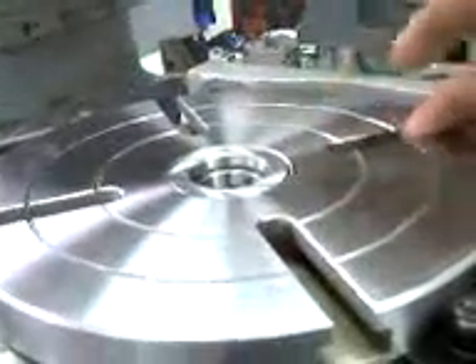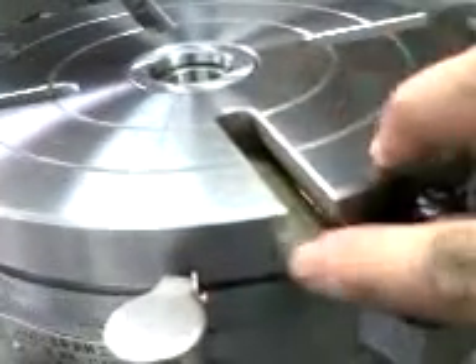We'll do a little video on the rotary table — just a quick look at what we got. Here's a flat surface, it's got T-slots in it. You can see there's a T-slot and a Morse taper number three hole. It's made to put stuff in our mill so we can rotate slots, or we can put a little cam in it. This is an eccentric and things that call for that.